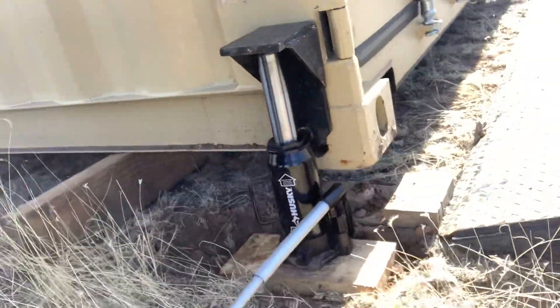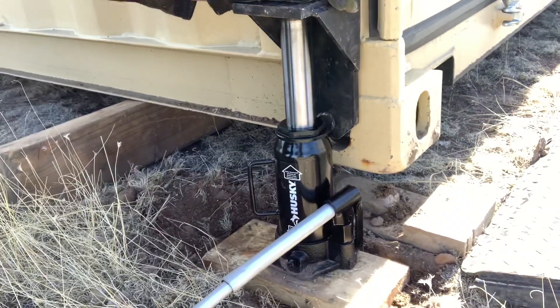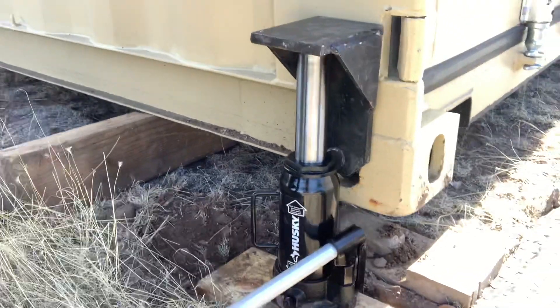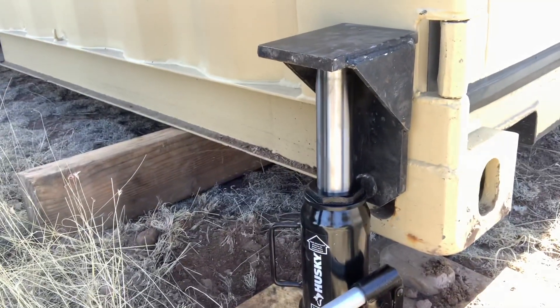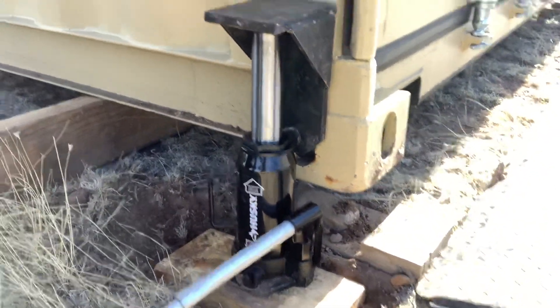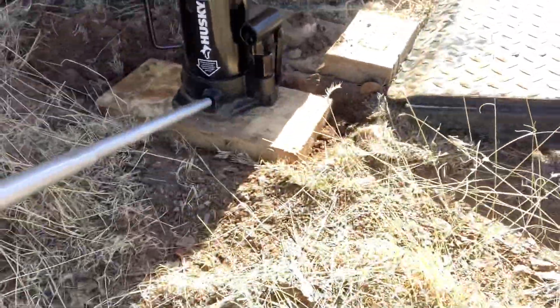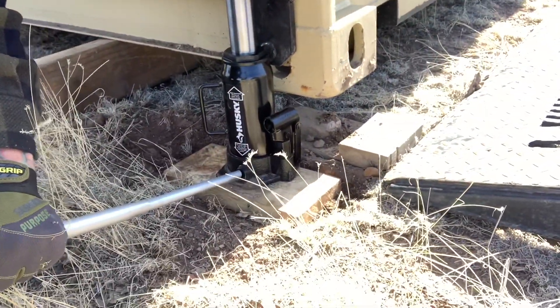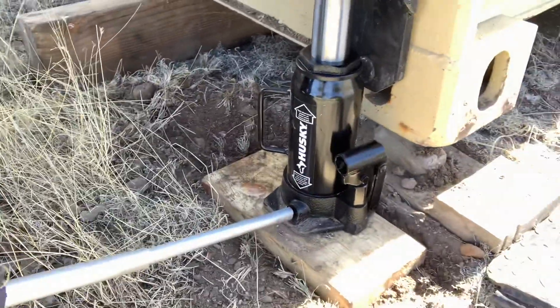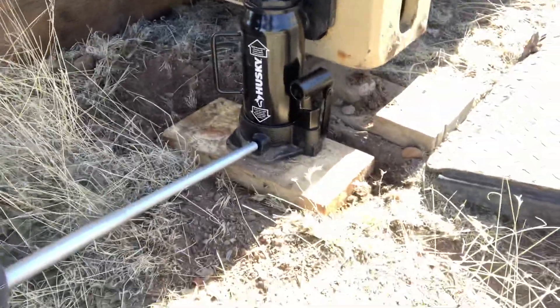So here's our jack, and here's what they call a leveling block — Superior Containers leveling chalk or something like that. I'll do a picture of that in the description so you guys have a better idea. Here's my 12-ton jack, my wood is in place, my skids are down there. I'm going to realign those — it's precarious but it's worth saving your deck. I'm going to go ahead and just turn this and we'll see it go down. Now we're sitting firmly on that 4x6 right there, in the ground.